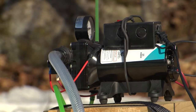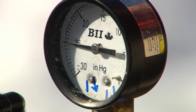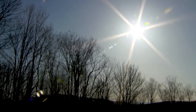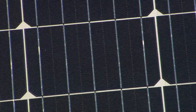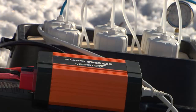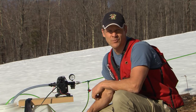We have a very small diaphragm vacuum pump. Here we're getting about 25 inches of vacuum, which is extremely high — very good production. This pump is running off of a deep cycle marine battery, which is being charged by a single hundred-watt solar panel. It's also powering an inverter, since the pump for the RO takes AC power. The pump is running continuously, constantly pulling vacuum on that tap hole and generating more sap.